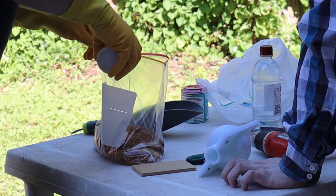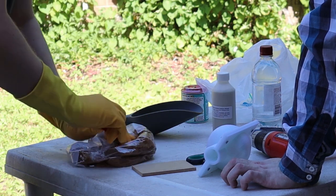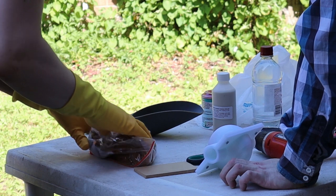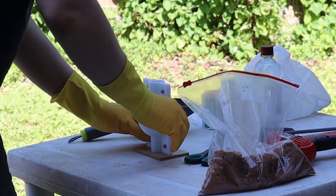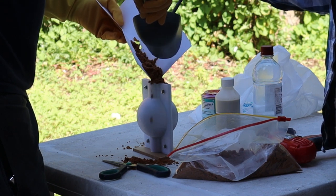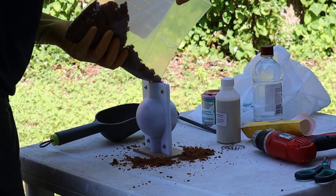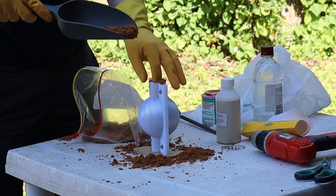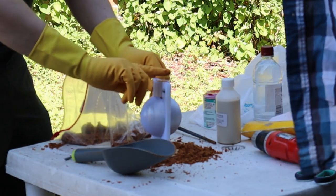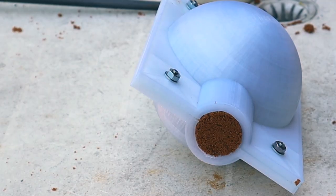The core is made from normal silica sand mixed with sodium silicate. In this instance, I tried seeing if I could get away with standard builder's sand from the hardware store, as the core didn't need to have a particularly smooth surface finish. Unfortunately, I bought the wrong binding agent for the sand. This is core glue, which is used to glue multi-part cores together. What I actually should have bought is sodium silicate liquid. I persevered anyway to see if the core glue would still work. When mixed with the core glue, the sand was quite sticky and didn't go easily into the mould.